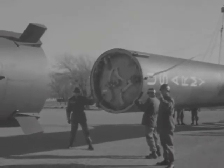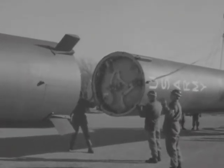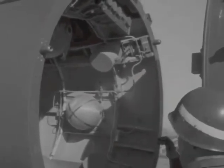The completed missile body resting on the warhead trailer will now be mated to the missile thrust unit. The thrust unit is now suspended from the A-frame rigging. The two sections were aligned for mating with the use of 6 ball and socket guide pins. The two missile units were then secured together by threading 6 explosive bolts through the 6 guide pins.